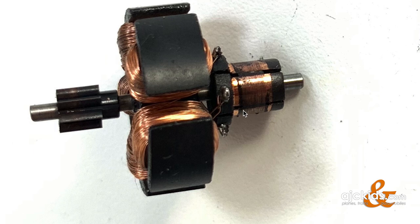If your armature looks like this, you're in trouble. This is an armature that needs cleaning. As you can see, these grooves are filled up with carbon residue — it's a mixture of oil and the fine powder, the fine leftovers of the brushes, that will cause this to build up between the plates of the armature. And when that happens, the electricity can actually flow from one plate through that residue in that groove to the next plate, and it will cause a short circuit.